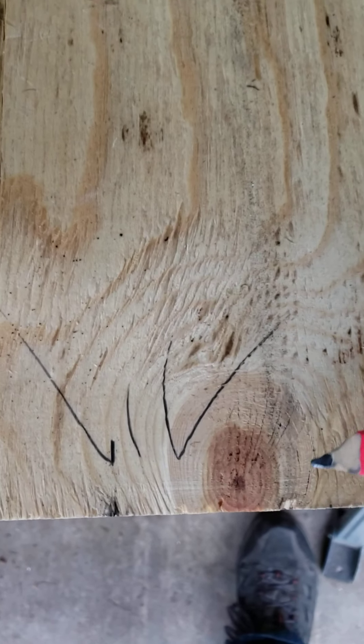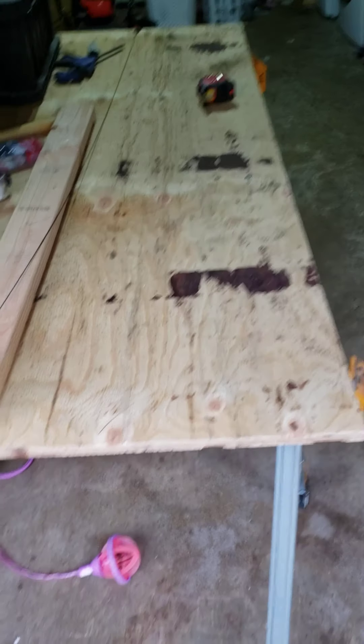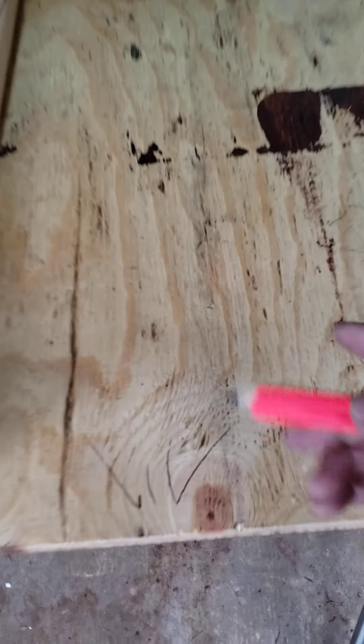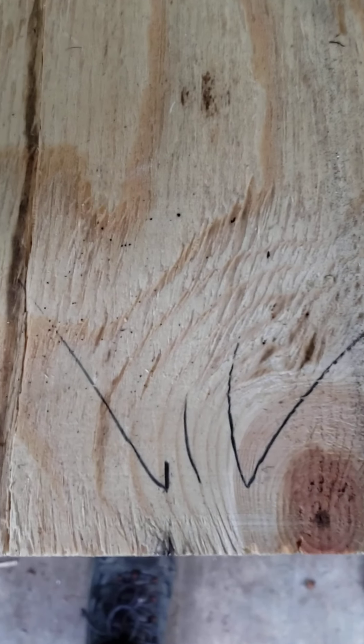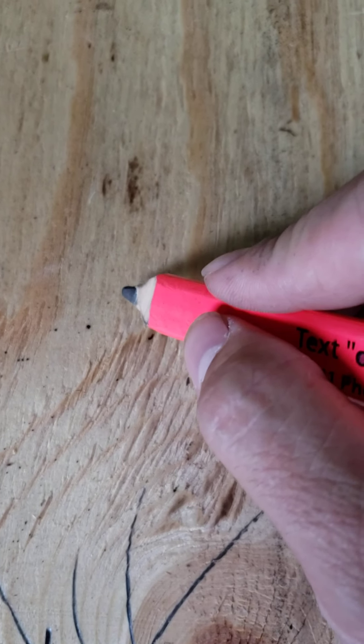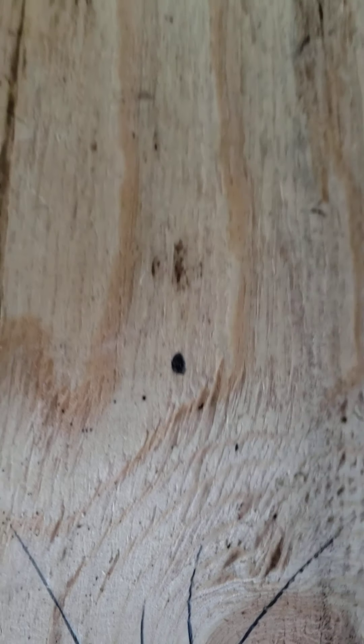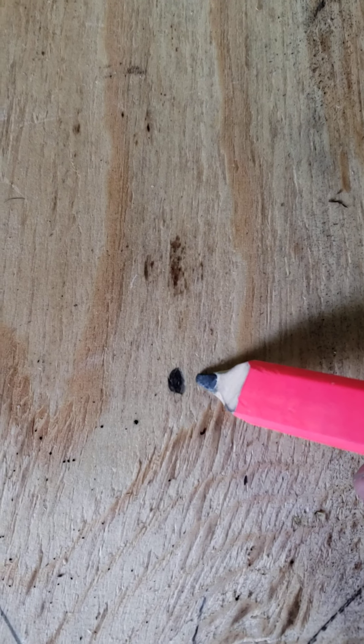Now the main purpose of a crow's foot is so it's visible from a distance. If you had to make a mark down there and then come back here, you're not going to be able to see a small mark. I've seen people make a mark, especially depending on what they're cutting, and they use a marker and they make a dot. That's not going to work because what part of this fat dot are you going to run your line? You could assume the center, but you don't know — it may not be a centered mark, so we try to avoid those.